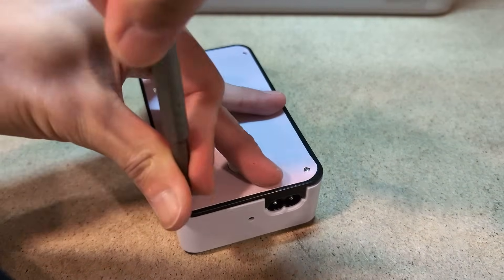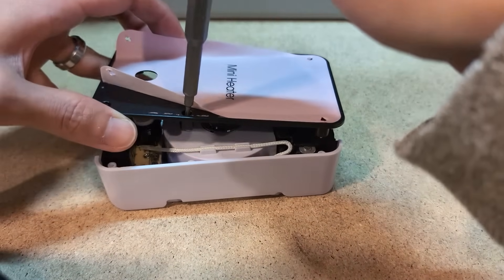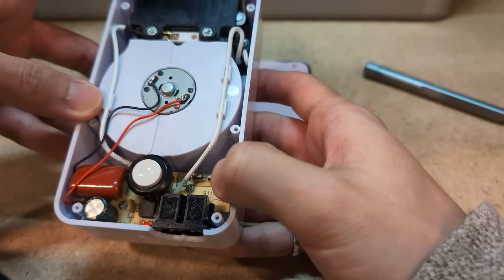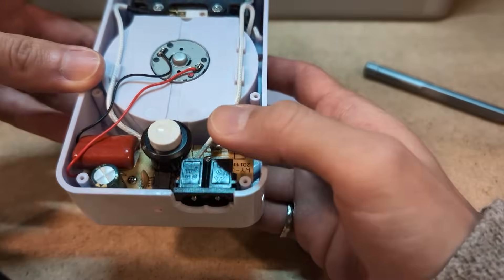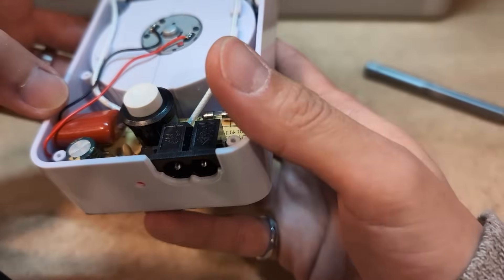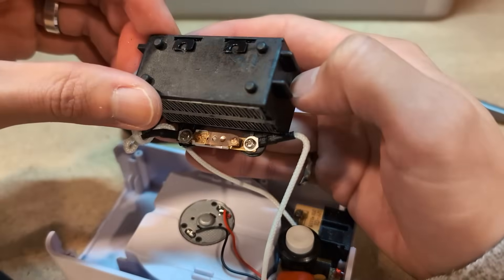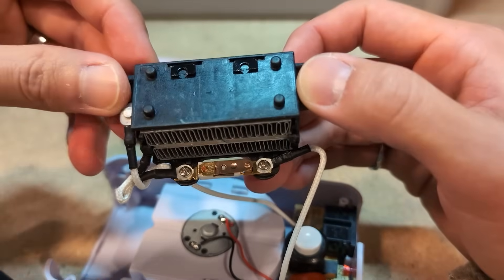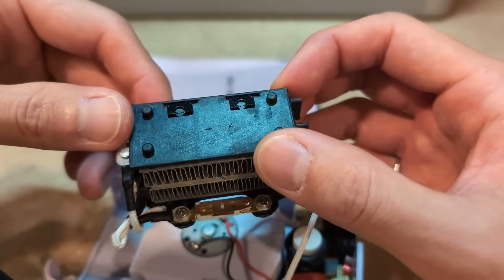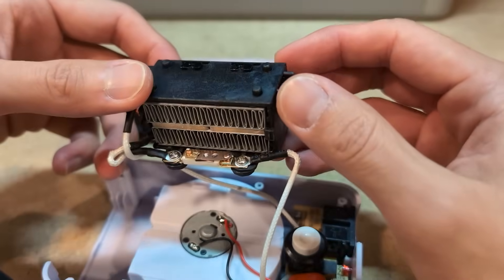Okay, so we're just going to take this apart. And we're in. Power plug, there's a fuse here. We've got a button and a bridge rectifier, and a giant capacitor and a couple of capacitors. So this is the PTC element. It looks like it's in some kind of injection molded enclosure. You can tell this is a glass-filled polymer — something with really high heat resistance — because you can kind of see by the sheen of the plastic, that's an immediate telltale for a glass-filled polymer.